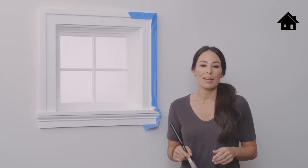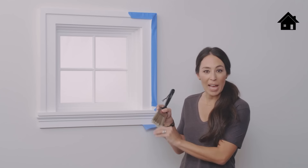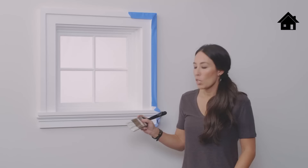After conditioning the brush, dip it into the paint — but don't dip the brush all the way up to the metal part, which they call the ferrule. Once paint gets underneath there, the bristles actually fall out and cleanup becomes a lot harder. So dip it in the can only about an inch.